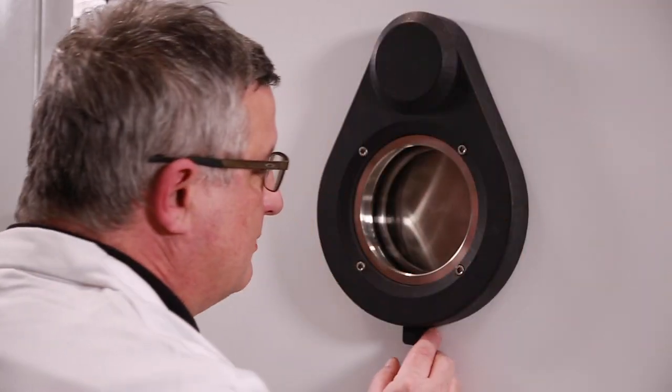Our process takes place in a vacuum, and while some see vacuum technology as added complexity, for us we see it as a benefit. Vacuum technology has been around for many years and is in fact very mature. With vacuum technology we get less contamination of the powder bed, less oxidation of the powder bed during the process, and powder flows more easily in vacuum. Ultimately, therefore, powder life should be increased.